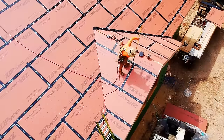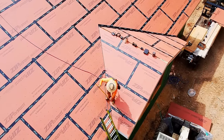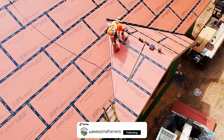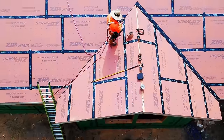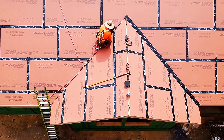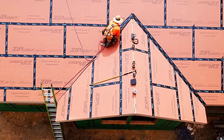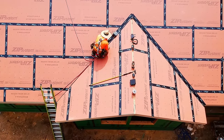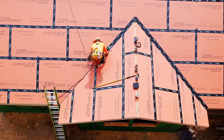So we use this sheathing on the walls and the roof. The roof is half inch and it's sienna colored. And the reason why we tape it is that dries us in. So the red facing or the green facing on the walls basically takes the place of your weather resistant barrier or your roofing underlayment, depending on your local codes, of course. So once we tape the seams, we are now dried in, with the exception of the ridge, because that's gonna get ridge vent. But we are now dried in, and the roofing is applied directly to this. I'll put a link in the description.